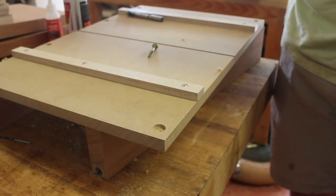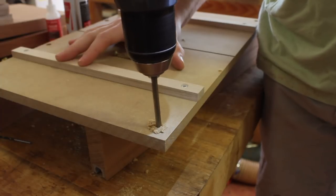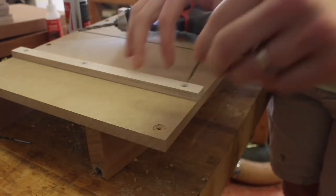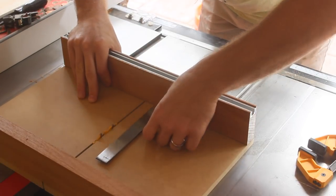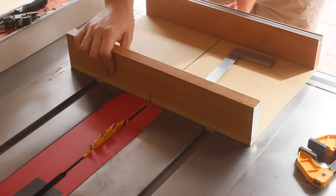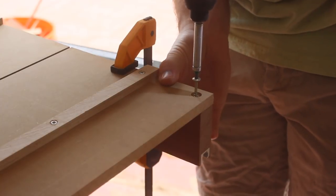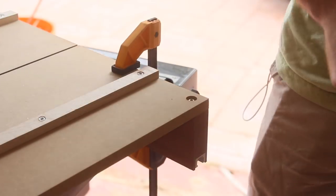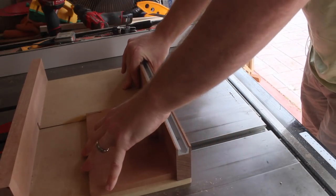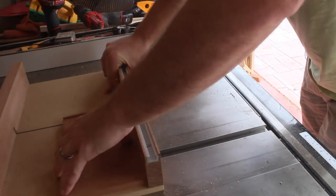The other corner gets a counterbore and oversized hole so that the fence can be adjusted as needed. I used a 6 inch machinist square to align the fence to the blade. Once it seemed square, I pulled the sled back and clamped the fence in place, then sank the pivot screw. The test cut was about as square as I think I can get it without more precise tools, but if it hadn't been square, I would simply repeat the process. The counterbore screw on the one corner allows for repeated adjustment.